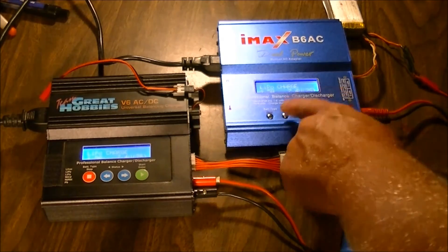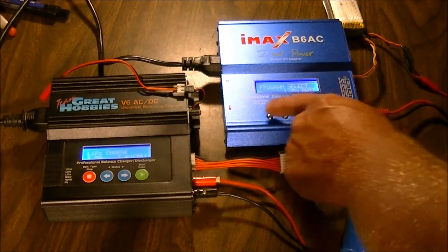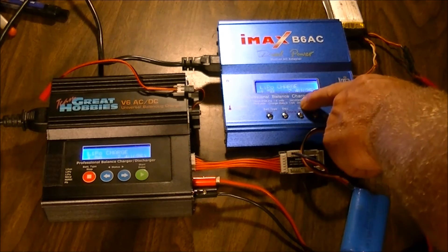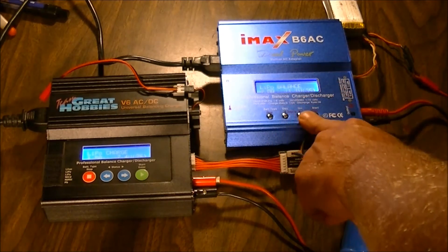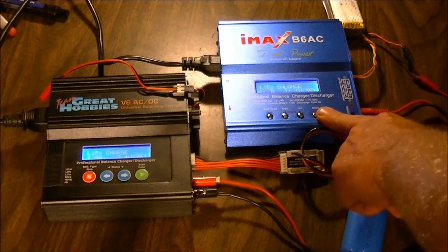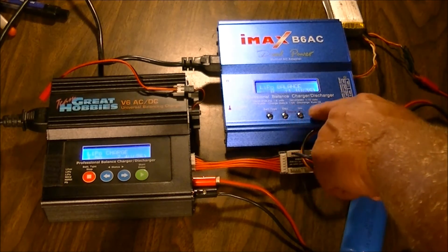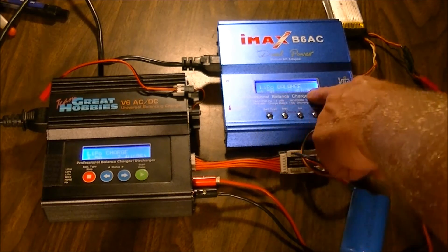Let's stop these. Now we're still in the LiPo charge mode, so let's go back here to LiPo battery. I'm going to press the INC button — or forward button. LiPo balance, 2 amps, 3S. In this case, 1.5 amps. And back button or descend button — 2 cell.